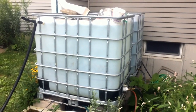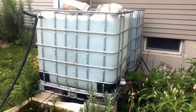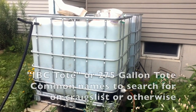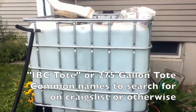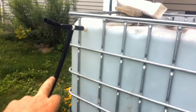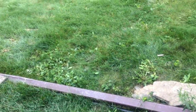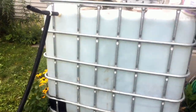I'll give a quick overview here first and then we'll go right to the very beginning and go through each of the steps. You can see there's two totes here, I think we picked these up for about $100 a piece, pretty clean and pretty easy to rinse out. We have an overflow pipe that takes the excess water and sends it away from the house, pretty much just as far as the old gutter did, preserving the dryness of the foundation.